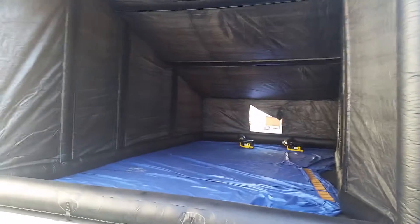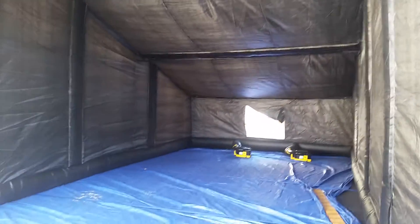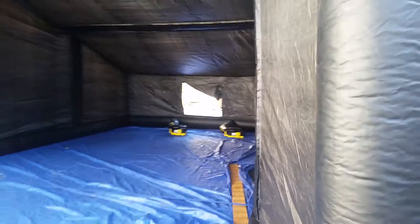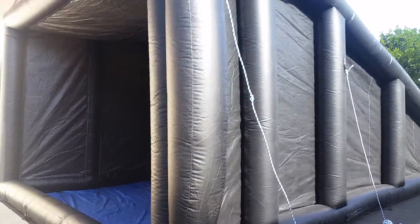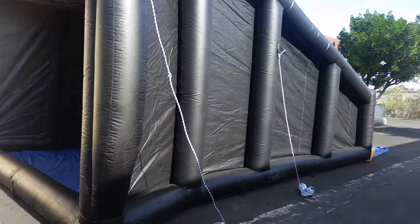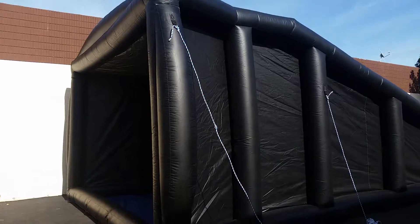As I go around to the front, you can see we've got the back door open for it. What you're going to do for daylight projection is rear project, and then you want to eliminate as much light as you can between the projector and the screen. Then we'll use a special high ambient screen, and you get the brightest projector you can afford, and you can project in the middle of the daylight sun.